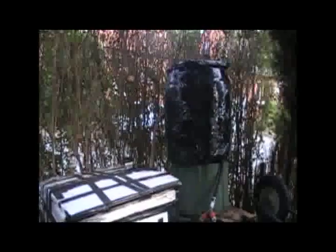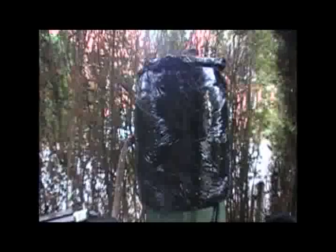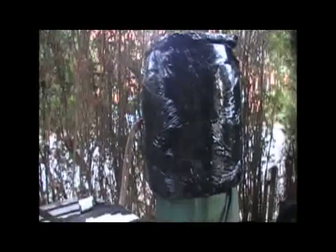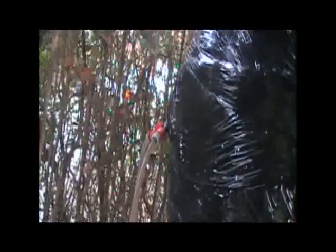And so there we have the elevated insulated 60-liter barrel. It's elevated now so that we get more thermosiphoning power. The cold water is under a head of pressure as it goes down into the composter and then comes out heated into near the top of the insulated vessel. The temperature outside is 24 degrees, and the temperature inside the composter at present is 37.3.